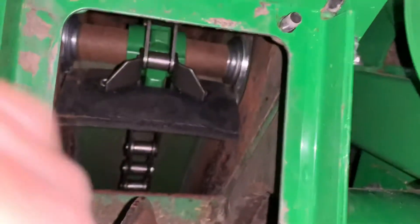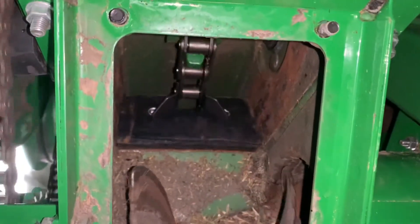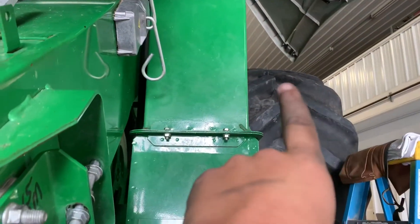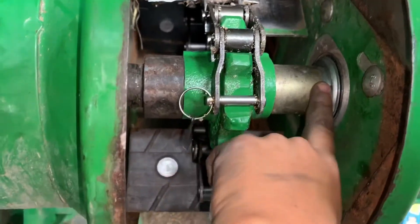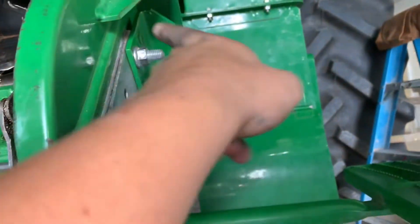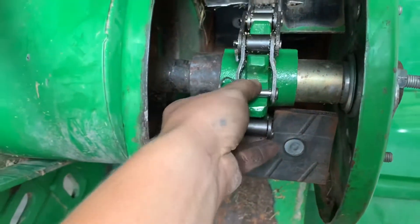So here we've switched that sprocket, and here's the new chain. You can see this auger moves and that chain moves when I'm turning this point. Here it is down on the bottom — I was sitting up there when I was talking last. You can see we have this chain and new sprocket. And I just have to slide this shaft up so that we can get this connected. I'll loosen up these bolts right here, slide that up, tighten it back up, and then get this chain hooked up. Because right now it's too short.